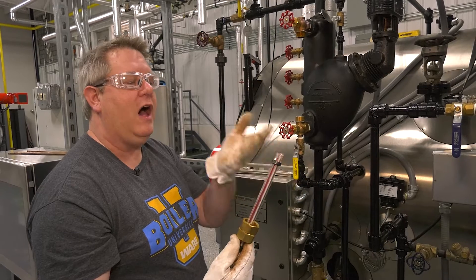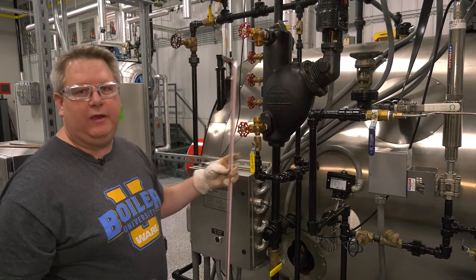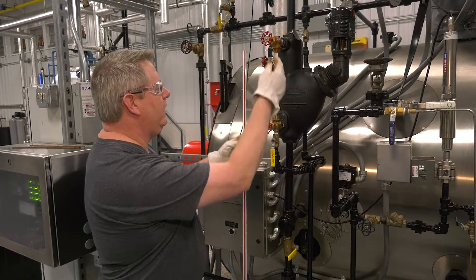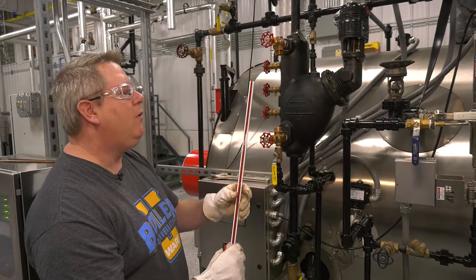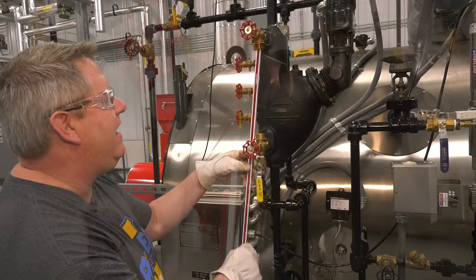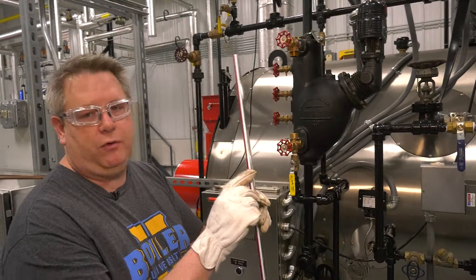This one is chipped. So how am I going to tell exactly how long that sight glass needs to be? I've got a new piece of sight glass and we can immediately see it's quite a bit longer than we need. Learning how to cut sight glass effectively is going to save you a lot of trouble. The proper sight glass measurement is going to vary depending on the brand and style of isolation valves, so the easiest thing to do is just cut it in the field. When I install the sight glass, the top end goes up into that valve and the bottom has to clear the brass. So I can simply make a mark, give myself an extra eighth of an inch or so, and when installed, it'll sit within both valves.